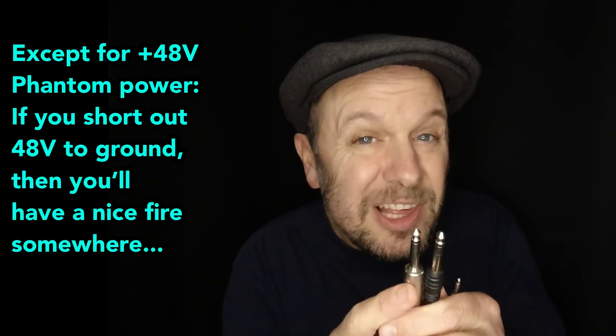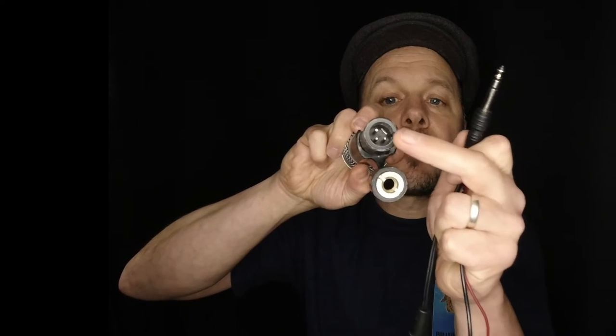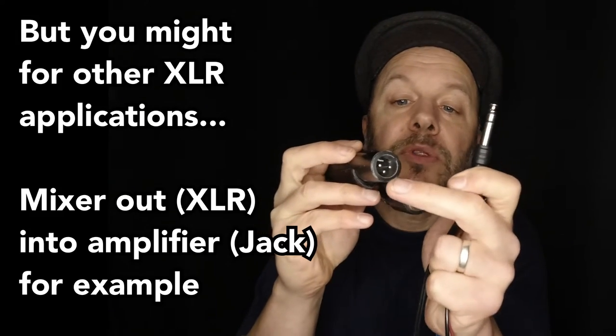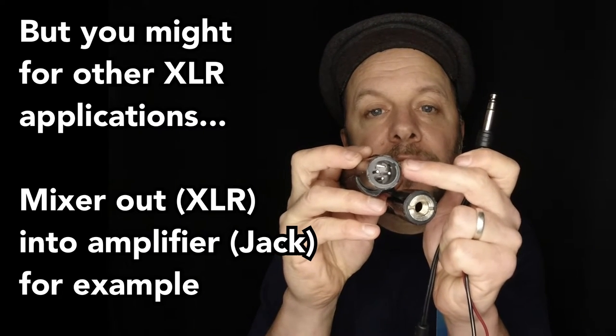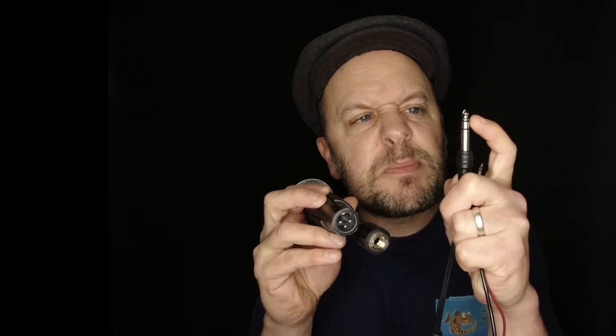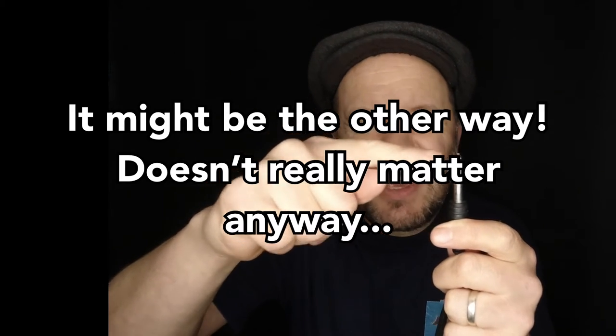When you're soldering up an XLR connector — you can see the XLR in the end of the mic with three pins — the pins are labeled and molded onto the plastic inside the XLR connector. Pin one is always ground. Pins two and three carry the two signal legs, and these can actually be switched between American and European standards. The American standard says pin two is the positive signal and pin three is negative; in Europe it's the other way around. It doesn't really matter as long as it's consistent, especially if you're sending two channels.